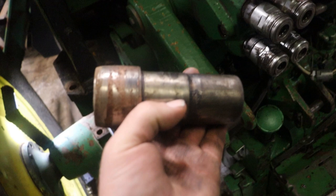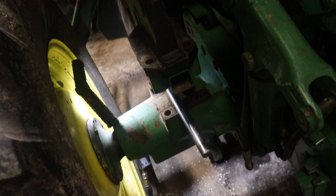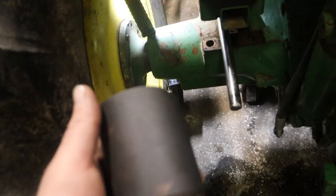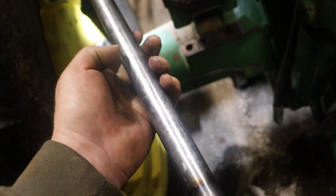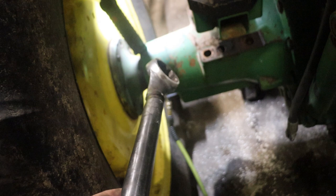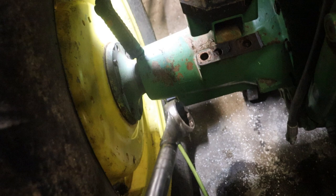What we got is there are four pins like this — you can see the top one right here and I'm rigged up on that bottom one. You got that cup with just a simple threaded bolt that goes through it. If you're going to do this on your own, when you order that puller from John Deere, I would get an extra bolt. For the different tractors there's a deeper cup and a shallow cup — I always start with the shallow one. We welded up an inch-and-seven-eighths box end to an old load shaft out of a 40-20, so you can put that on the bolt or the nut. More times than not, you want to get the bolt all the way threaded in and use the nut to turn — so if you ruin anything, you ruin the bolt, not the threads inside the pin.